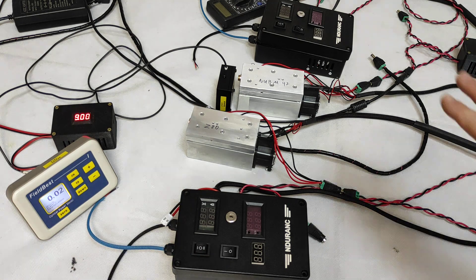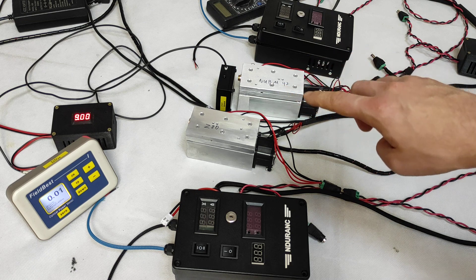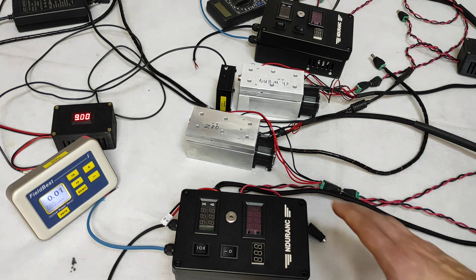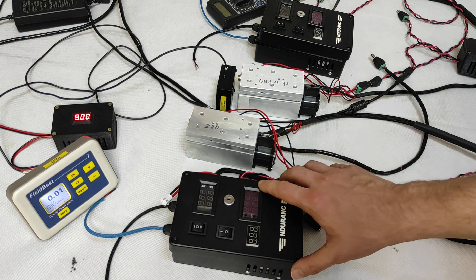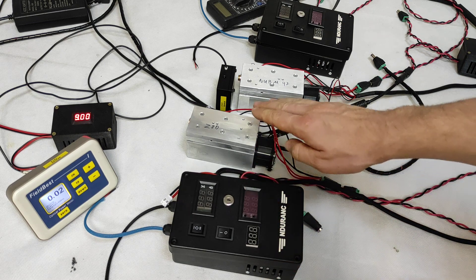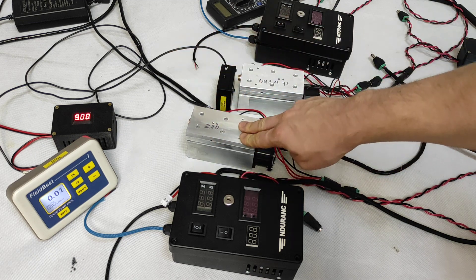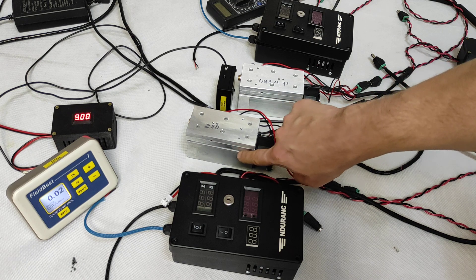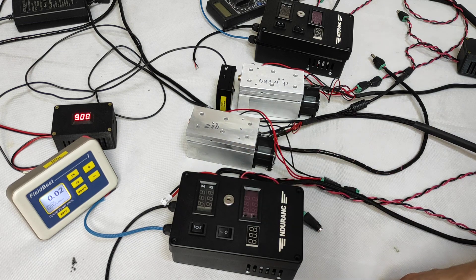We will compare with our previous diodes that we were using — NUBM44 and NUBM47. So they are like two different modifications. As you know, we updated our laser box. Now we have a temperature control system that keeps your laser temperature in range. It turns on and off our two TEC plates, two Peltier coolers. We have a temperature stabilizer — it's very important for diode lasers to extend their lifespan.